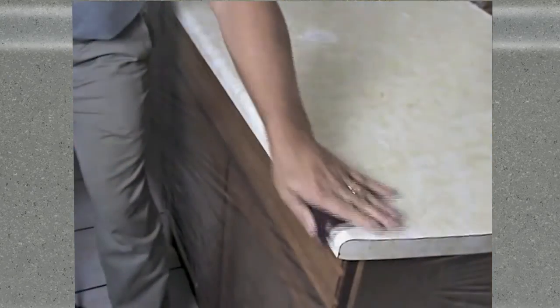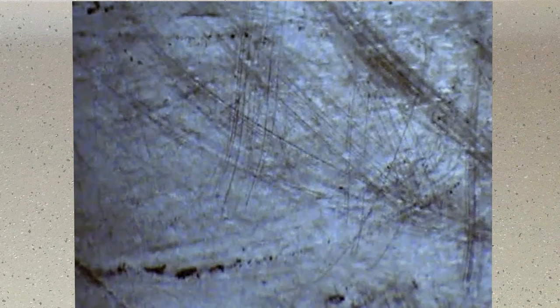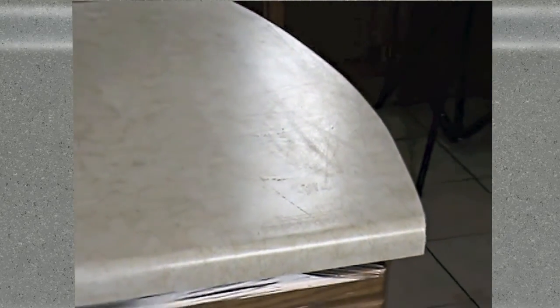Now that the area is masked and all surface repairs have been made, the final step is to thoroughly scuff the laminate surface. This is important because it will create surface profile to which the countertop primer coat will effectively bond. Use the 80 grit sandpaper in your kit. There is no right or wrong way to do this step — just scratch it up. Do this to the whole surface, then wash it one more time to remove any fine sanding debris and you're ready to go.